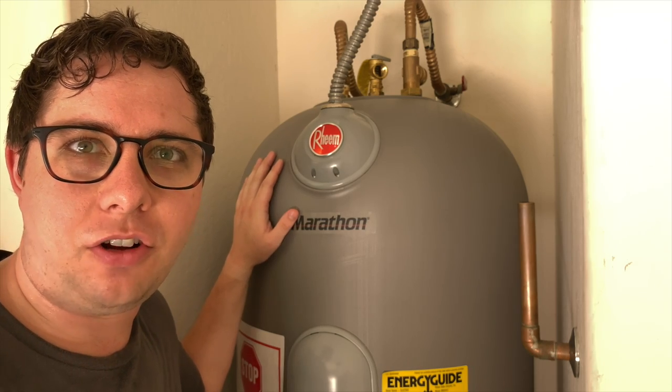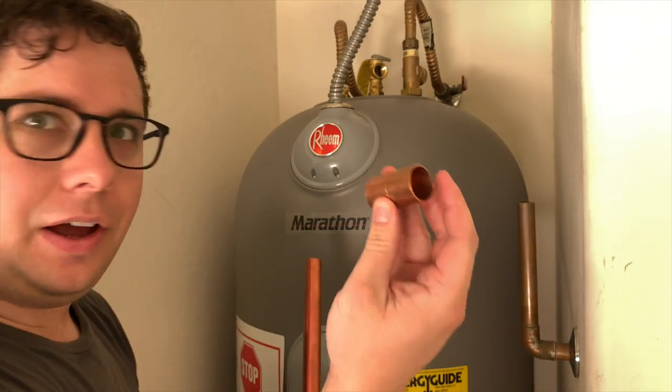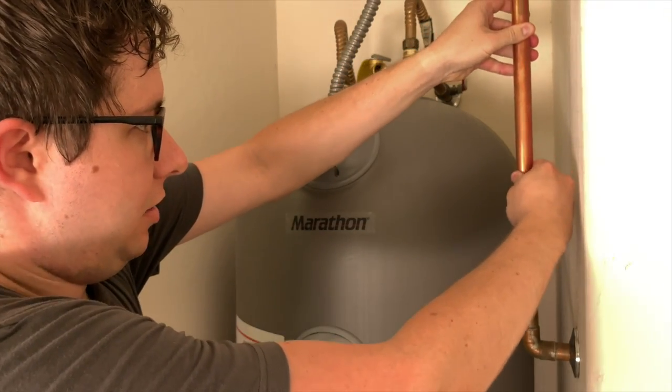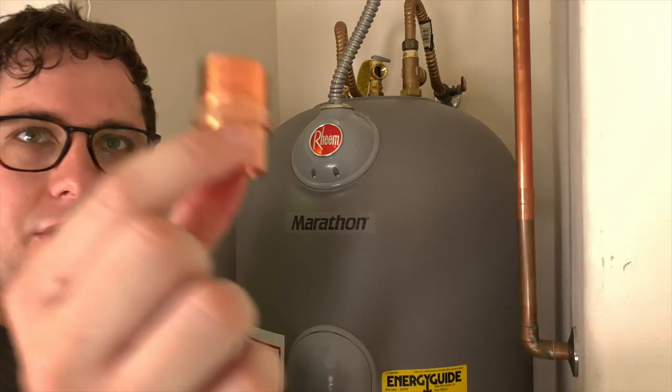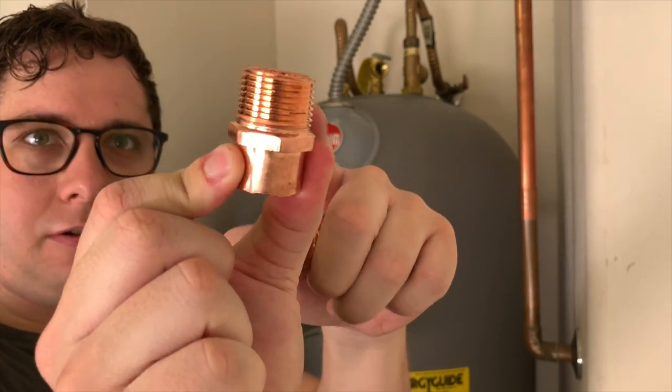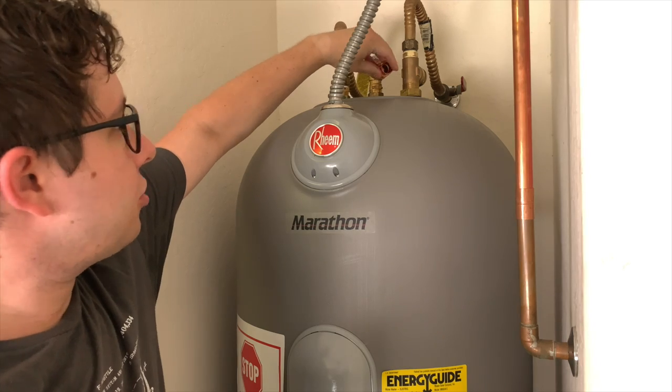This water heater is about seven and a half inches taller than my old one, so I have fittings and more copper pipe. I have a three-quarter inch copper pipe with a fitting, add a length of copper, solder connection here and here, then cut the pipe and use a fitting to make it turn — two more solder connections. And lastly I have a copper-to-male pipe thread three-quarter inch connector that gets soldered onto the last piece and screws into the TPR valve. My house already has this set up so it drains directly to the outside of the house — in case of emergency when the tank is overheating and needing to relieve pressure, it just dumps the water out.